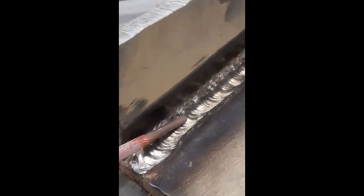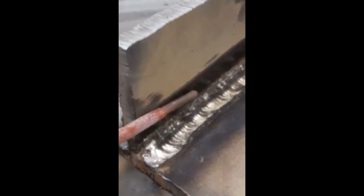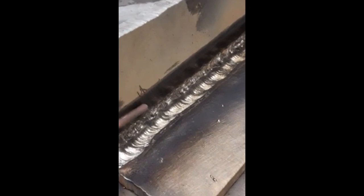It's bonded to the wall of this piece of metal. It also overlaps the root bead. The third and final pass that he makes will overlap the first 7018, the root bead, and this portion of the T-joint.